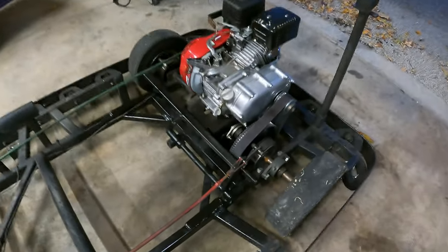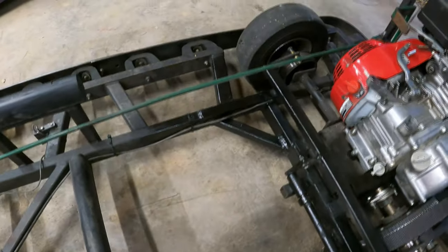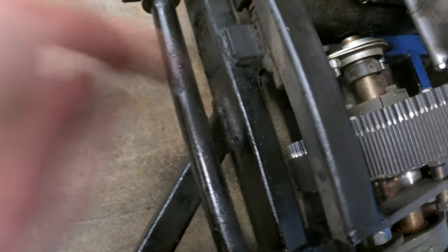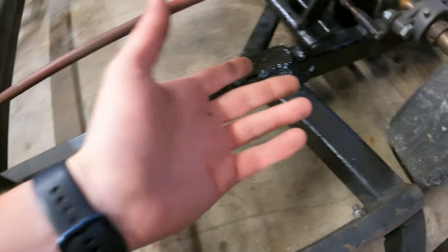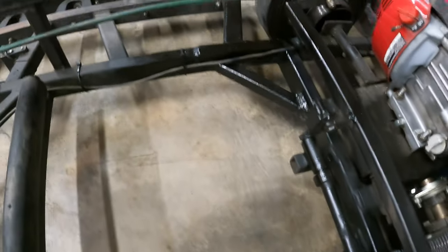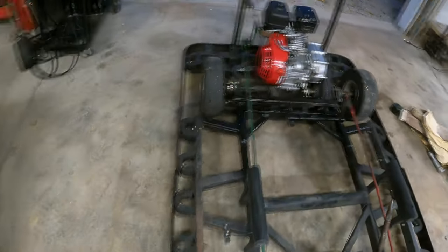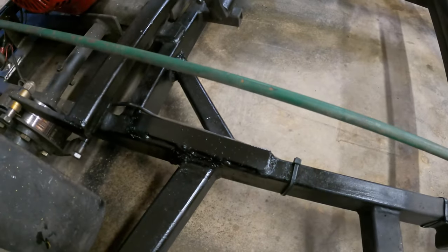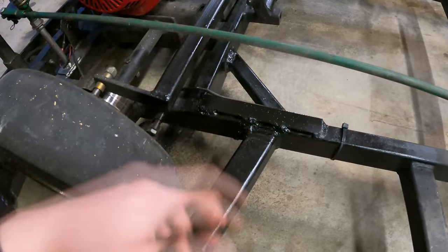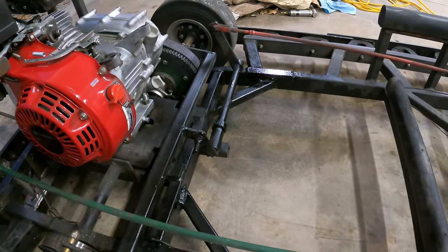Everything's painted and the safety wire is re-zip-tied down. I went through and redid any of the old cracked welds — here's one example where I laid a nice new bead. Any welds that were totally cracked through, or spots that were never welded at all, got fully welded. Two pieces of angle iron on each side, all painted up with black engine enamel. I was riding it around wondering how many years it was cracked like that with people on it. I feel a lot better now. Hope you guys enjoyed the video — let me know suggestions, questions, or comments below, and we'll see you in the next one. Peace out.